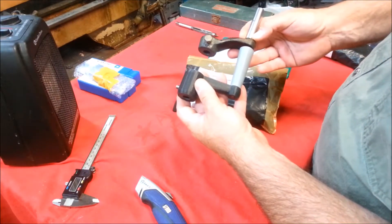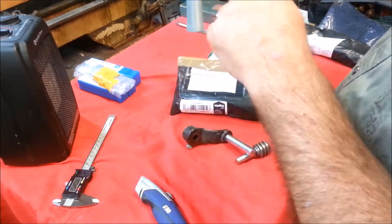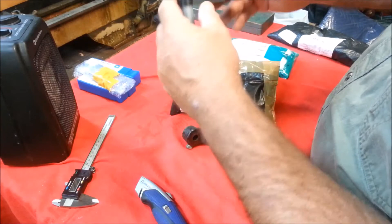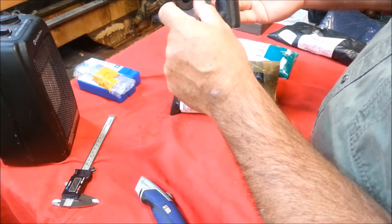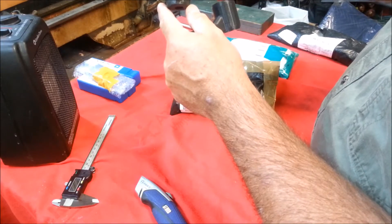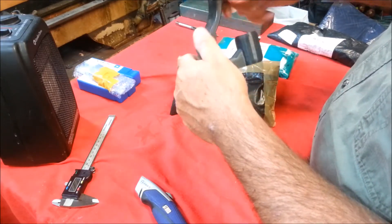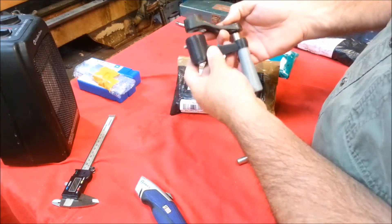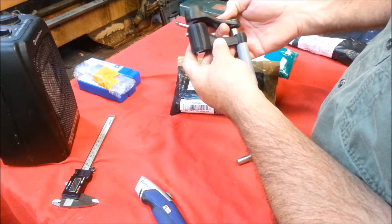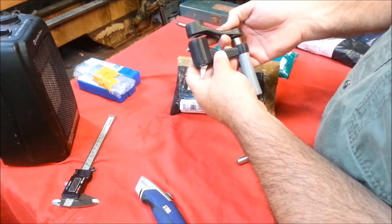Functionally, very similar. This was printed with this section down on the glass. Something like this is a little more difficult to make and get a nice layering. You've got to think of the layers of plastic kind of like the grain of wood. So this is how I redesigned this part so that it would take best advantage of 3D printing.